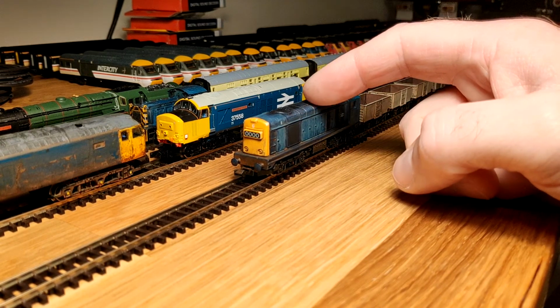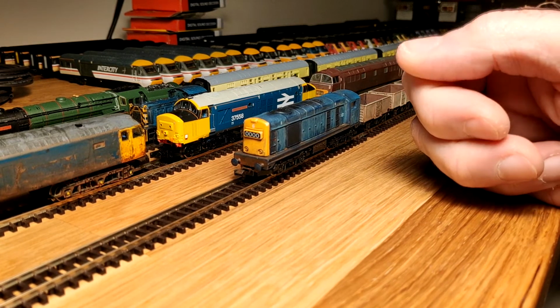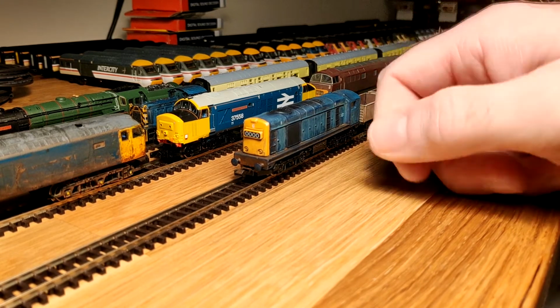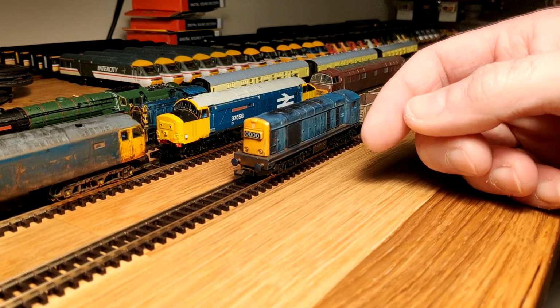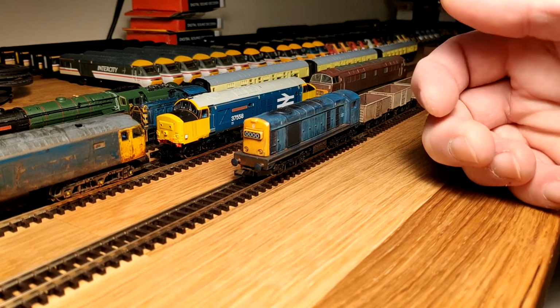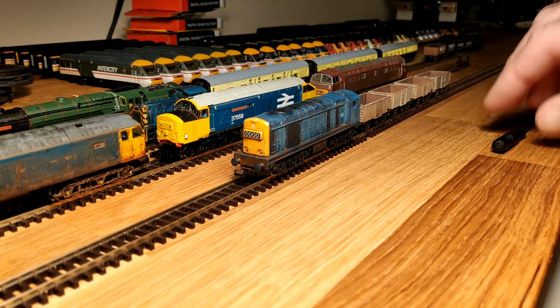These are quite forgiving motors, as long as you clean the commutator contacts with a Q-tip with a bit of alcohol and just clean them now and again. If you get oil on any motor on the brushes, it basically makes them cease to exist. Like, they won't run.